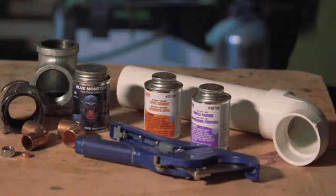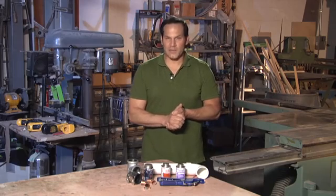If you're dealing with copper compression, ferrules and nuts, they also require you to cut them beyond the ferrule, remove the nut if you want to. You could always reuse the nut, but if you're at it, you may as well replace it, along with the ferrule. And this was how to loosen pipe fittings.